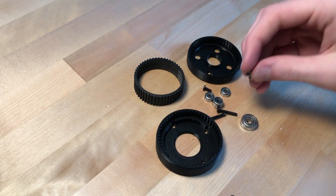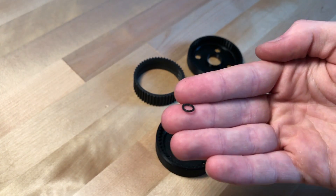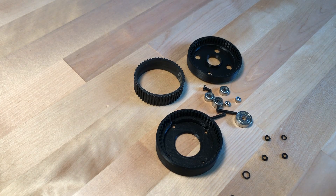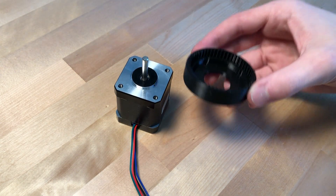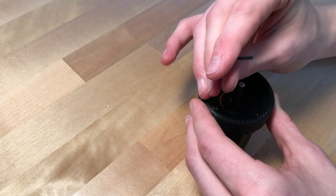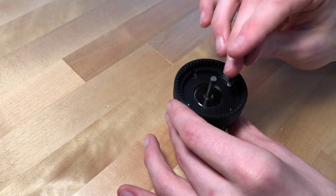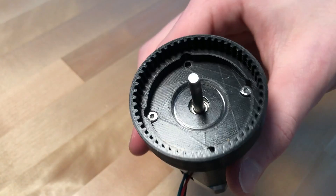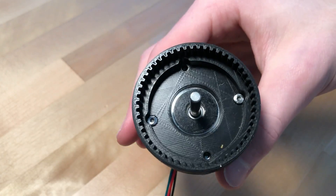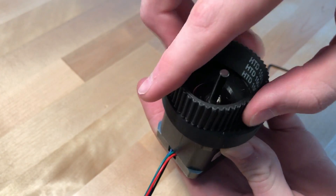I have a couple of M3 lock nuts — I've ground them down a little bit to give me some clearance. I 3D printed four small 3mm washers and one 5mm washer. Most of these pieces are their second or third iterations. The first thing I need to do is mount this bottom piece to the motor using the two M3 by 6mm screws. I ground down the heads of these screws to give me a little more clearance for the internal mechanism. This bottom piece is an internally facing gear — it has 52 teeth and also has a lip on the inside. The belt will rest on top of that lip.